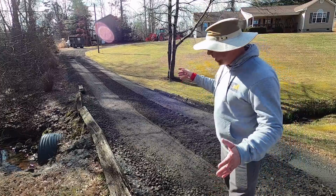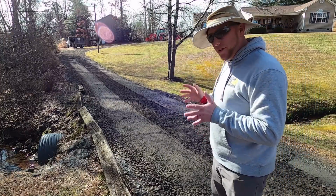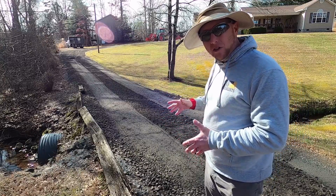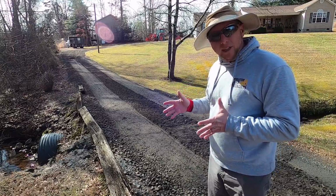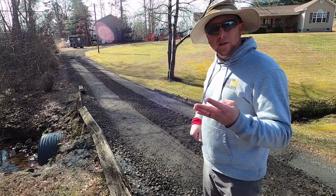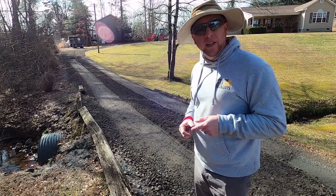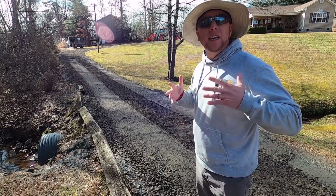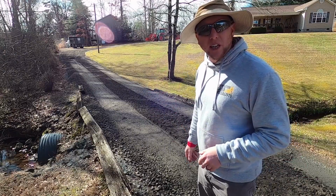Load of material, I'm going to come down here and I'm just going to go at a pretty good clip, but not quite as fast as yesterday in this section, because with it being damp material, I've gotten 4 extra links in the chains that adjust my tailgate. And I have a video specifically about how to tailgate gravel with a dump truck. Just search for it on the channel.